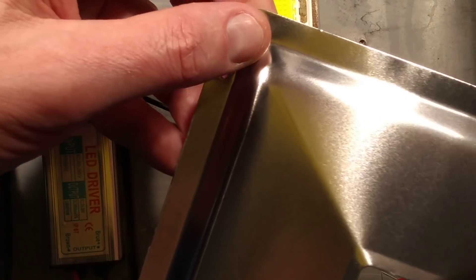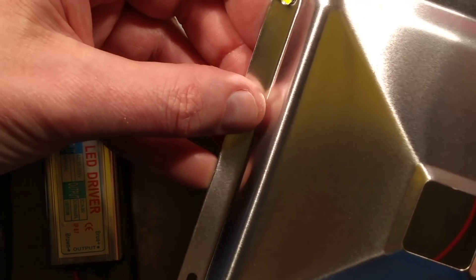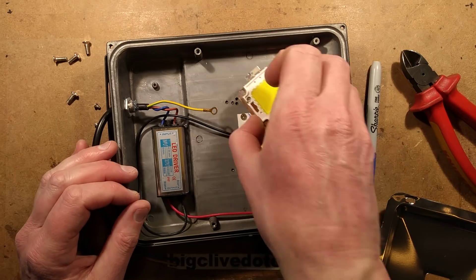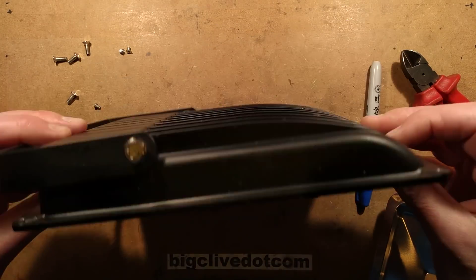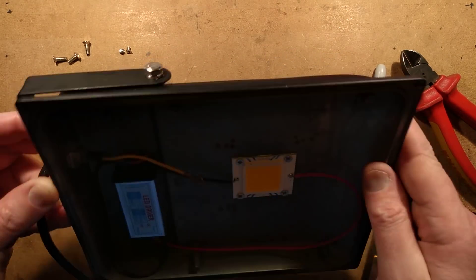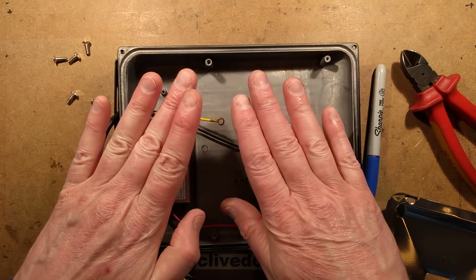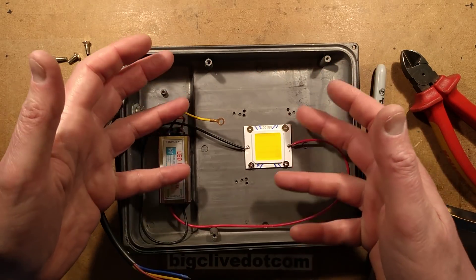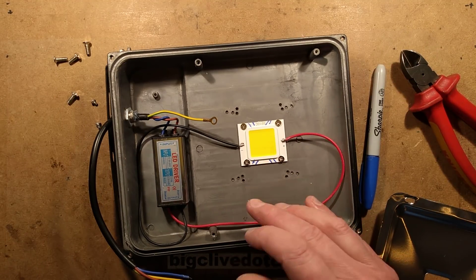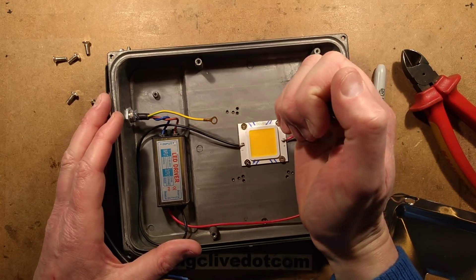This reflector is super flimsy — absolutely the flimsiest I've ever felt. It feels almost like barely above tin foil, but that's okay. I also wonder, if I was using these for flood lighting, assuming this heatsink can dissipate 50 watts — it looks a wee bit shy for 50 watts of heat. There's a possibility that if you don't need the glass, you could have this open so that air can circulate inside as well as on the outside, because it doesn't have to be waterproof in this application. I wonder if they've used heatsink compound underneath this — there's one way to find out, and that's to take the chip off.